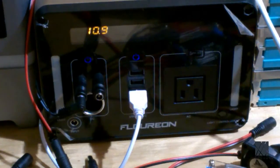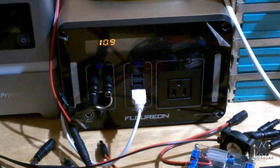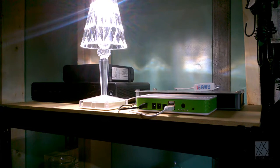Here is the Fluoron solar generator. I previously made a video about it in which I removed and disabled the vacuum fluorescent display — the controller had failed, lighting up all segments, getting hot and wasting power like a heater on the front of the display. I disabled it and replaced it with a digital voltmeter. So far this solar generator has been successfully powering my workshop, and I'm going to keep it on the workbench slash battery shelf. There's also a miniature portable power system functioning like a solar generator with a small solar panel feeding it. I upgraded it with a LiPo battery, and right now I use it for a miniature USB lamp that produces a noticeable amount of light.